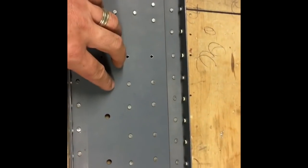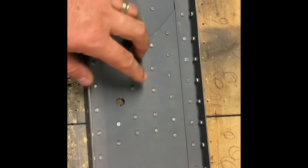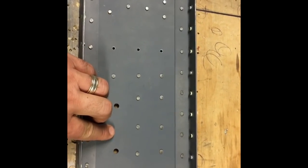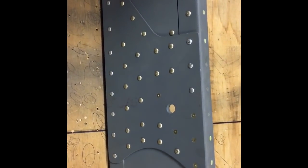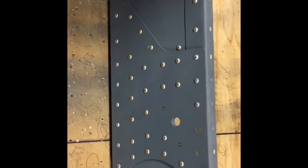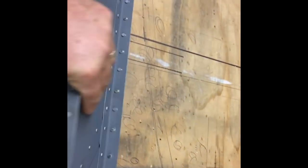Rib spacing is 14 inches. Here we've got an overlap instead of a splice between the outer and inner 63 thou webs. This is the strut attach here, and then there's an intercostal sort of thing between front and rear spars. There'll be another two on here, braced together. We've also got the doubler here to transfer all that load from the strut out and up along the wings. Heaps of rivets in the thing, took me ages.